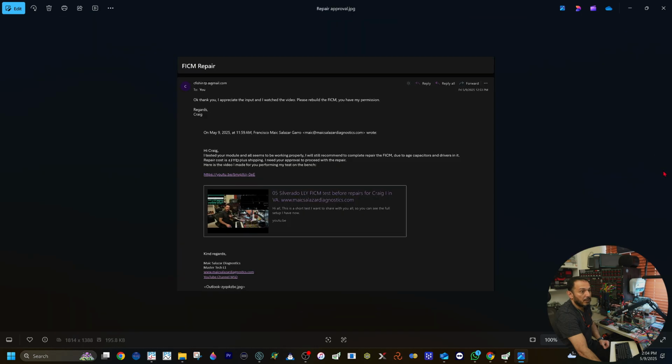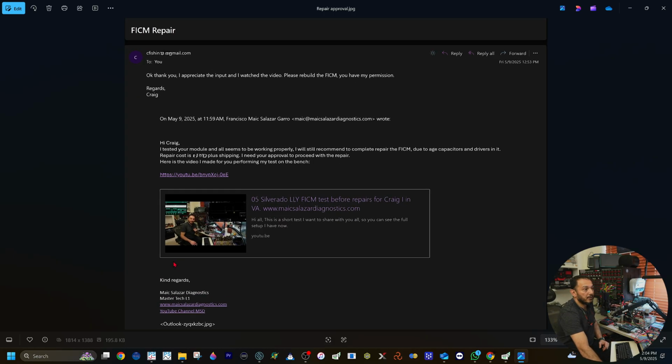But I am happy that Craig approved the repair. So here is the conversation I sent him. I say, hi Craig, I tested your module, and I'm always honest with every customer that comes to Mike Salazar Diagnostics. I tested your module, and all seems to be working properly. I will still recommend to completely repair the FICM due to the age of the capacitors and drivers in it.